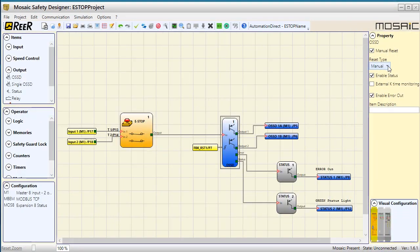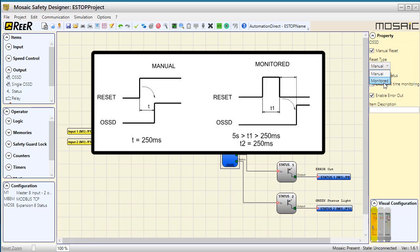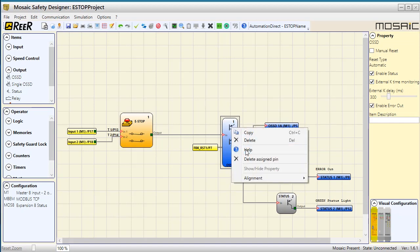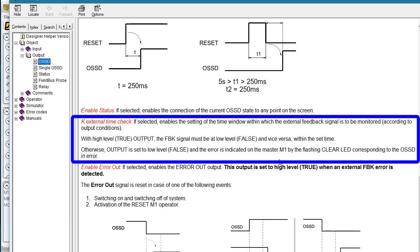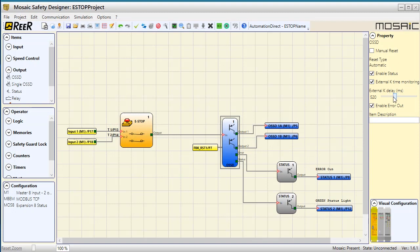We're currently running a manual reset. But what is this monitored thing? The manual reset just looks for a transition. The monitored version is the same thing but it looks for a falling edge too, so it has to see a pulse to reset the controller — again, additional safety. The last thing is this K-time monitoring. If you right click on any object on the screen, you can get instant help on that item. This tells us that the K-time monitoring limits the time between when the output goes active and when the controller should see the feedback signal react. You can set that time to anything you want — just another thing you can use to tighten up your safety system even more.